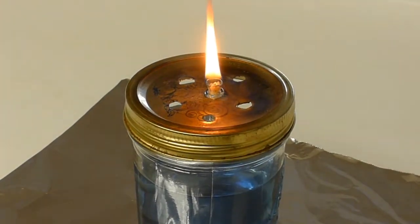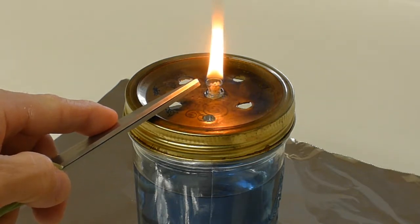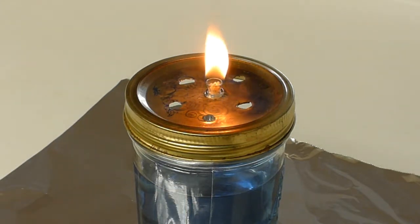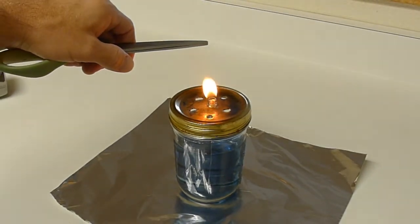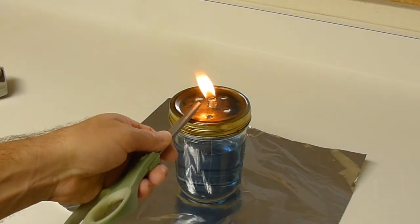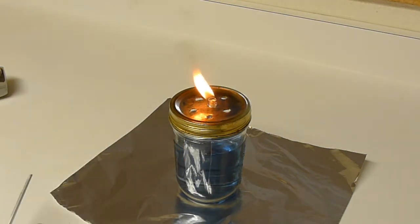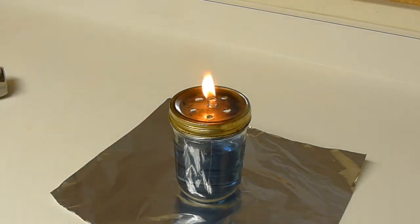You can definitely see that the positioning of the cotton in relation to the top of the flame arrester makes a substantial difference. We were getting a flame up to about here — and that was literally a half-millimeter difference in how much wick was showing. With the tops of the threads just a half to one millimeter above the glass, we were producing a much taller flame. Now with one or two threads just flush, my next step is to push it another half millimeter in.